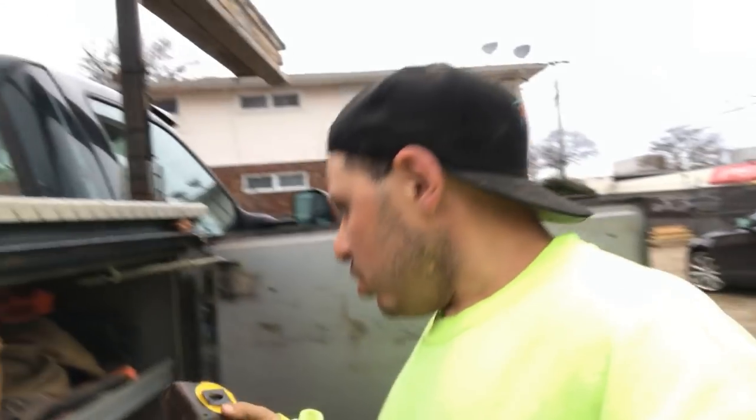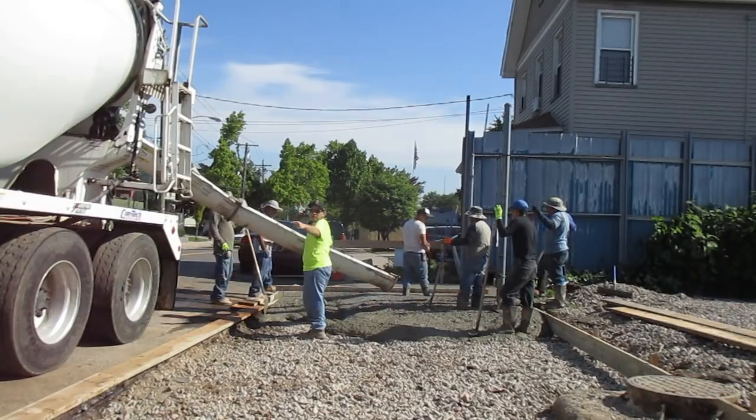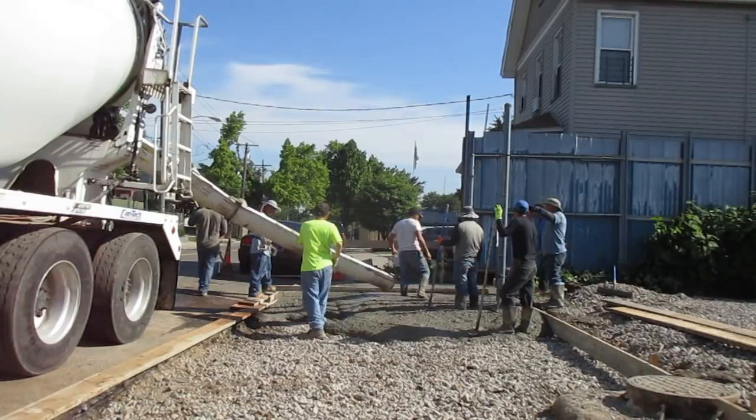Over here this is dirt, so on many houses you'll rip out existing concrete. But if you're going to remove dirt or stone, always remember it's double. A lot of people get confused when they dig out dirt — they don't estimate enough. The dirt gets fluffy when you dig it up, so even though the liquid concrete will figure out to a certain square footage, the dirt will be double that.